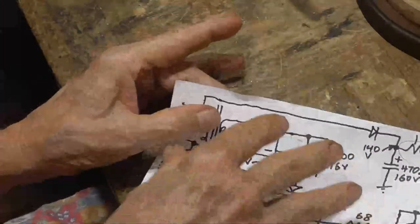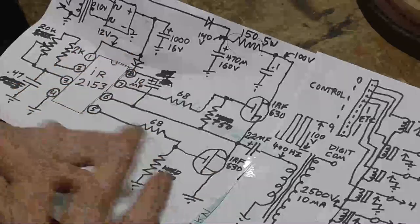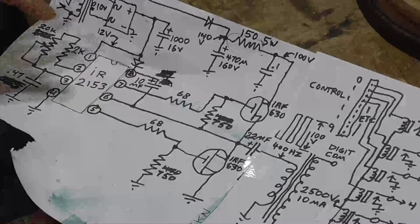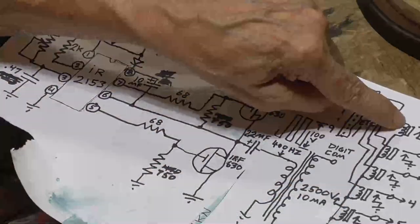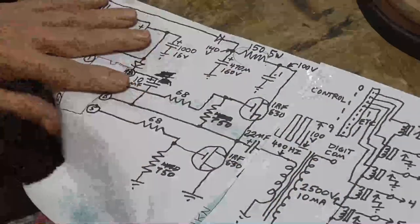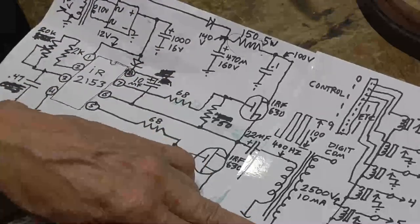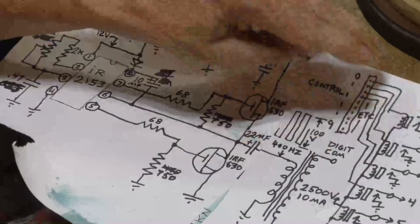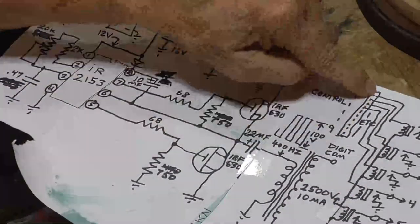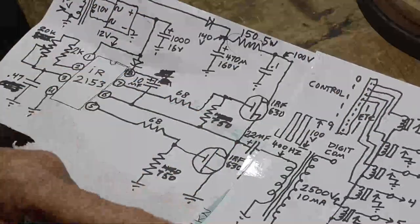Well, we don't want that in our control circuit. We don't want whatever's controlling our Nixie to be hot at certain times. We want it to be completely isolated so that it's always safe. So these relay coils are isolated from the main circuit, so we don't have any connection to it. And we supply a separate 12 volts from the circuit that's driving the Nixies to run these coils, and then our controls go to a connector here that has those relay coils connected to it.